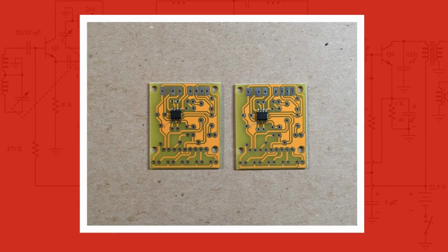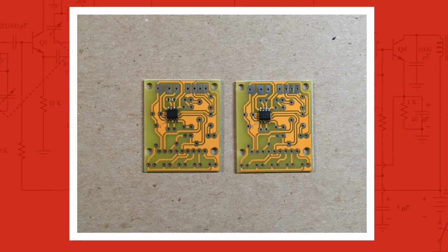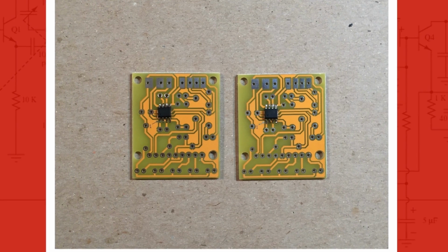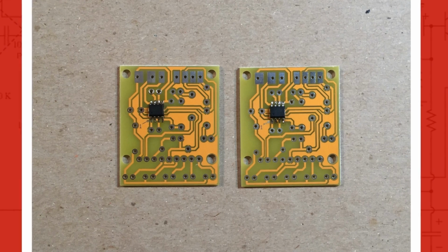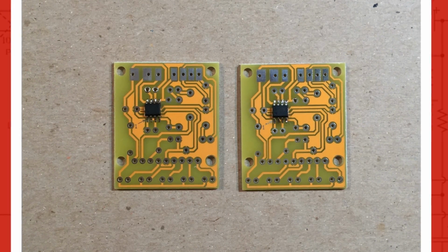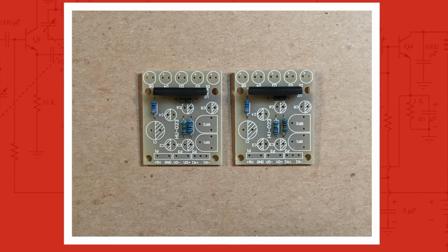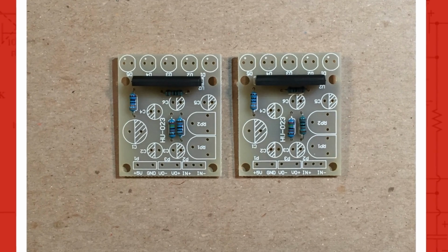Here are pictures of the build process. This first picture, I installed two of the 8002B surface mount amplifier ICs using the drag solder method. Note the pin 1 orientation. Take your time, use some tweezers, tack one pin down, flux the other leads, and then drag the solder. Works perfect. Second picture, the PCBs were then populated with 8 resistors and two KA2284 LED controllers. Note orientation on the controllers.